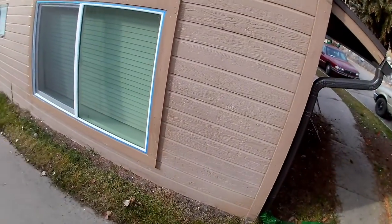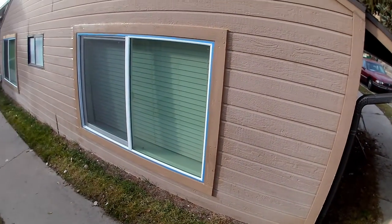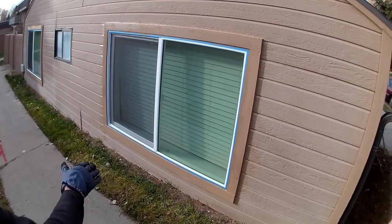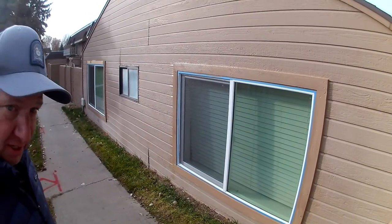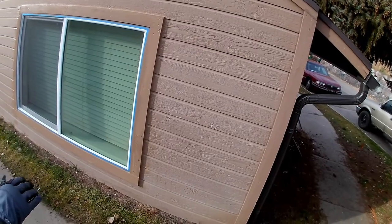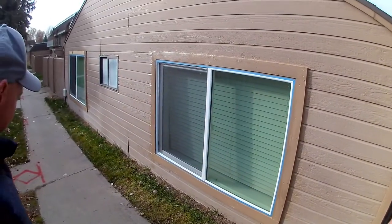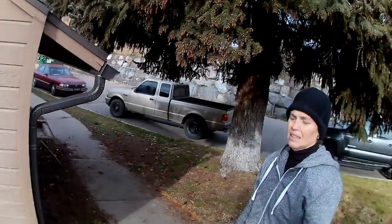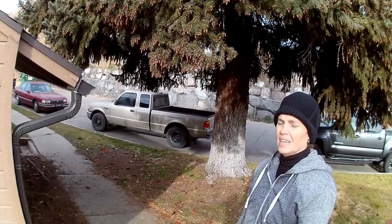What you can do is get the black four-inch diameter corrugated drainage tube - you've probably seen it. Bury that so it doesn't get pushed around, bring it down, and then daylight it out here. Your elevation here is actually a little lower than over there, so maybe you take it that way. This is an HOA, and they probably own and control the landscaping. They said no money in the budget this year, so if you want to fix it, go for it.